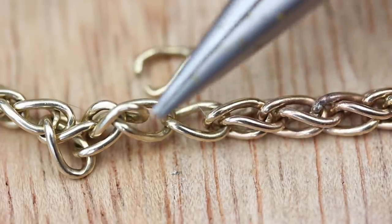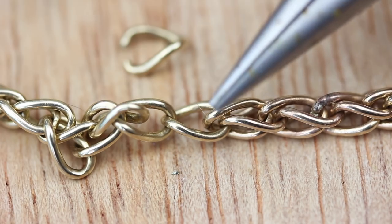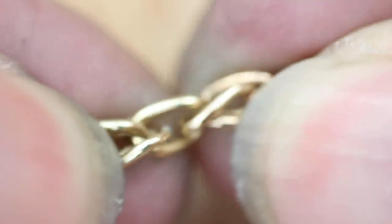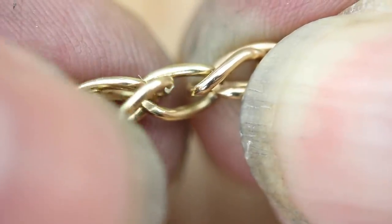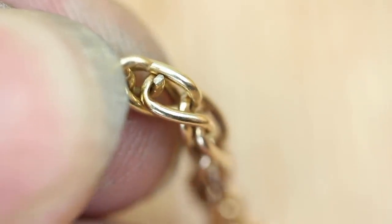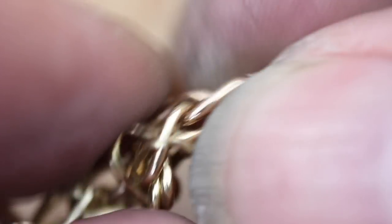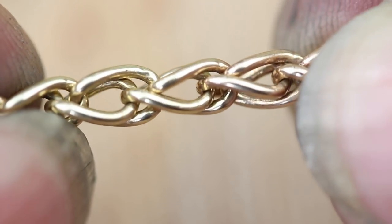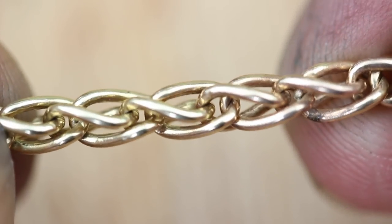You can see these two links automatically fall back into place. What I'm going to do now is thread this link back in between that one and that one there. You might think this is an impossible task, but it really isn't. I've threaded it through there and you can see — as long as it sits nicely — it's obvious where it's going to go. Just give a little squeeze together. And you can see, just by sorting out that one single link, I freed up about two inches of chain.